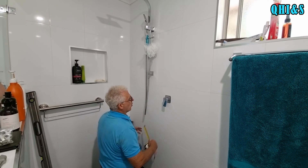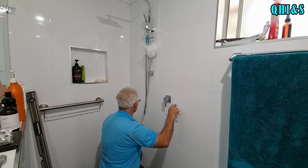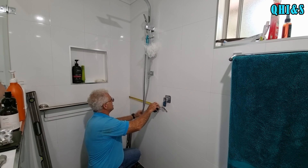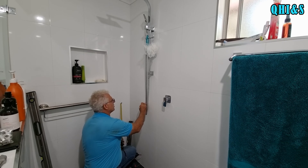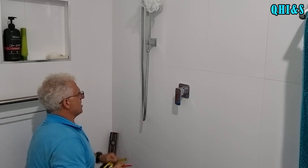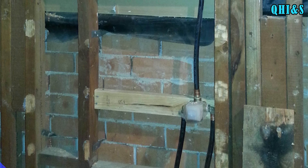Now this side is going to be a lot more complicated. Right here there are water pipes running through to the flick mixer, so we've got to be careful not to go anywhere near that. When I went into the roof earlier I marked that it's 387 millimeters from the wall, minus the tile — so I'll minus 12mm for the tile. The stud is basically there. We know it's 523 millimeters center to center going across.